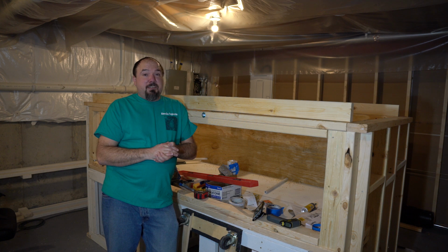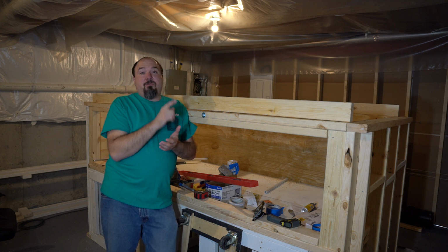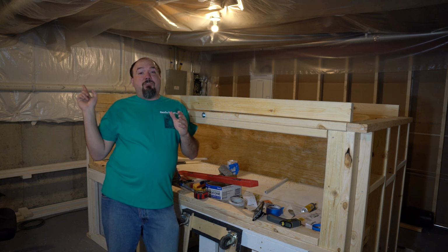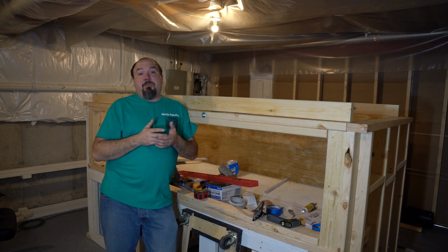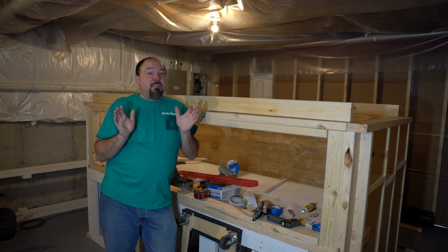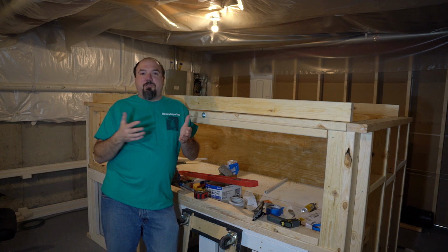The first thing I did was set up that RODI unit. I got into the hot and cold water lines, put some shutoffs in, and then I tapped into the main drain line of the house so that I could have a waste line for the RODI unit. At the same time I plumbed in a pump out for water changes, which is just on a threaded fitting, so if it has to be removed to access the clean out, you can do that.